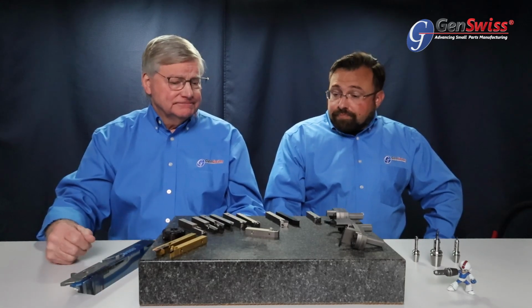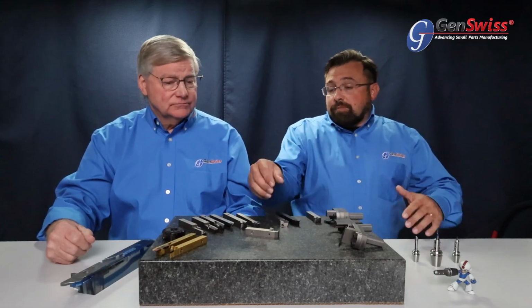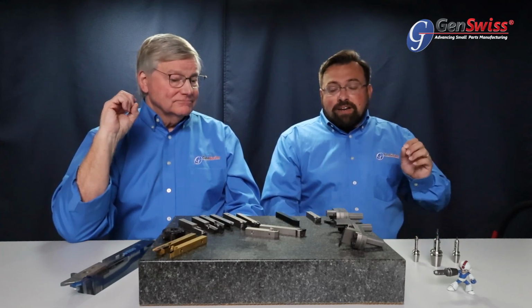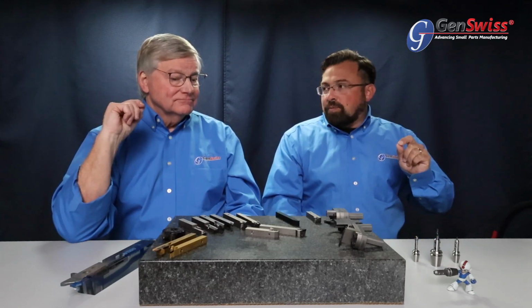Yep. On the other side, some of the more generic product there, or I shouldn't even say generic because it's not. It's a highly curated ISO product line. Curated. I like to use that word for it. It's an ISO turning line, so some of the common turning geometries like CCGT, CCMT, DC, and so on, we have all that kind of product available as well. But what's really key about it is it's all very sharp and very small radii.